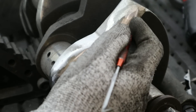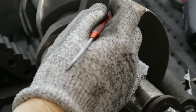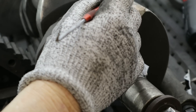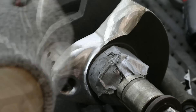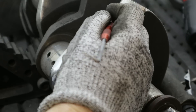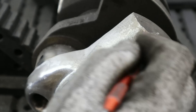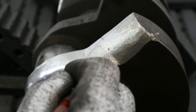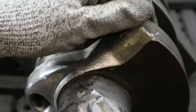Here's the corner roughed out. Points to note: make sure you don't have a hump just here. Start the radius right down about here and continue it to about here. We are going to put a small radius just to break the edge on here, but we don't want oil to be going into the area that the rods are sweeping out. So the next move here is to get there with the cutter and do the final shaping on it and then polish it. And here it is after cuttering.